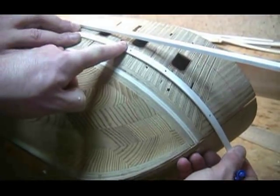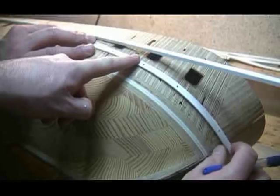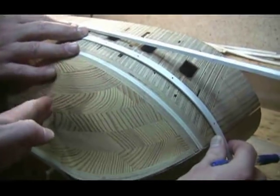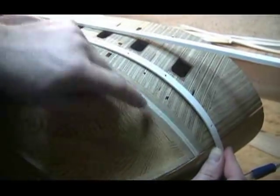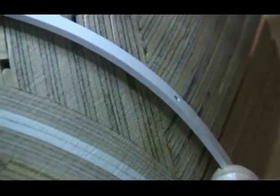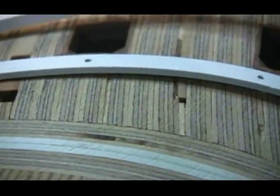Well, in this case, the shipwrights try to use here the timbers of natural curving, in order to escape from additional work. Yes, that's exactly right. The plank's going to have to be bent down a bit, and it's going to lead to a bit of kinking, but he's going to bend the wood to get rid of that.